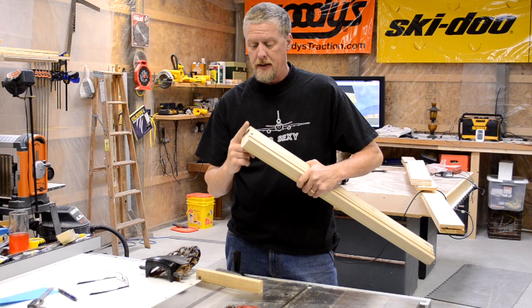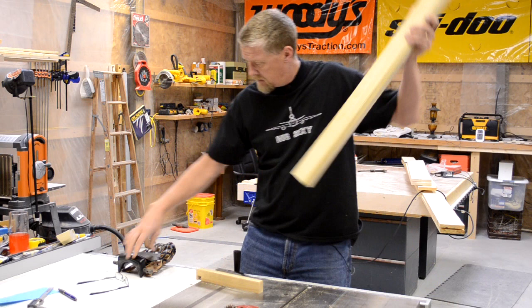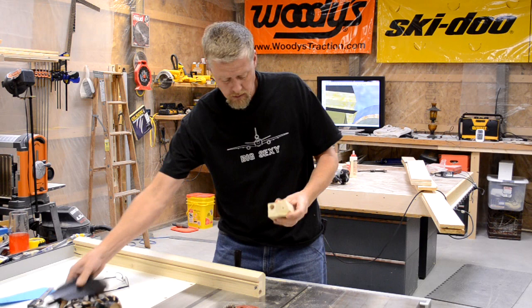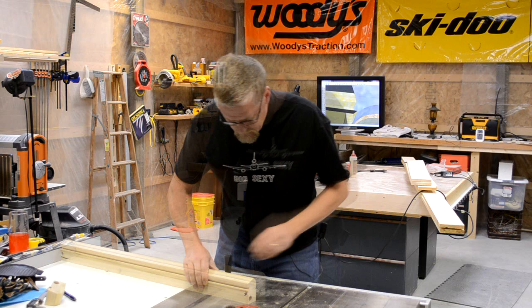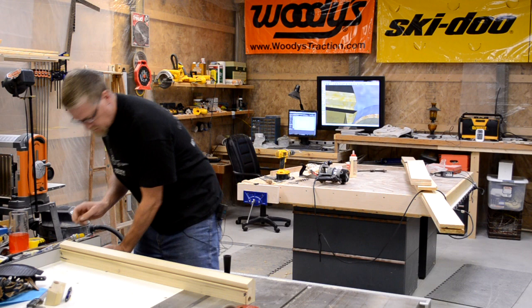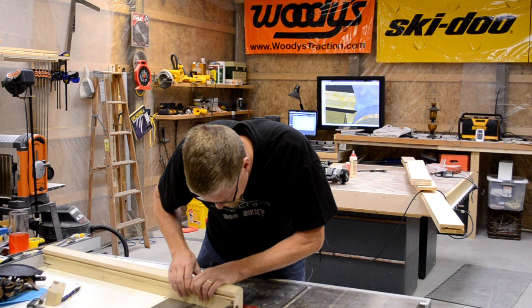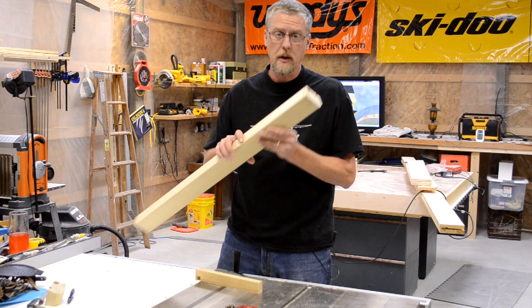And also, I'm doing the side pockets right now, so I'm going to be working with that little cove that we talked about. So I've got my miter gauge set up to 10 degrees. I got my rip fence set to the proper length, so I can just butt my piece up. And I've run a test block, and everything fits pretty good. I'm really happy with how that pocket just tucks into that little cove here. Should turn out well. That looks good. Now I'll take it over to the compound miter box saw, and I'll cut my compound angles for the pocket openings.